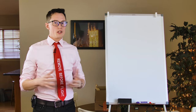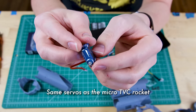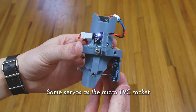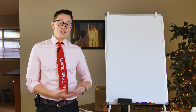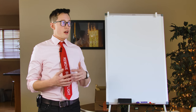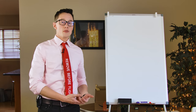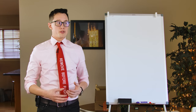The question is what's melting. The servos or actuators had plastic horns — basically plastic drive mechanisms — and they may also have had plastic gears inside. There are a few other assorted plastic parts in the fin mount. So there are several parts that have the possibility of melting or bending in heat. Going forward, we'll replace more and more of this design with metal parts or very high-temperature plastics.